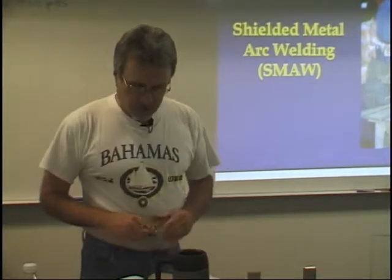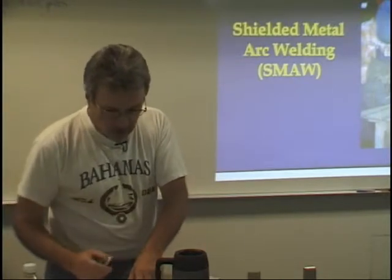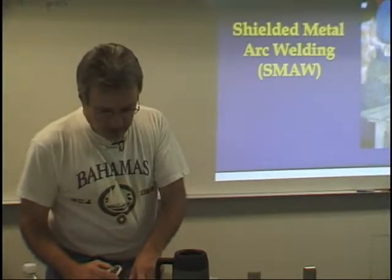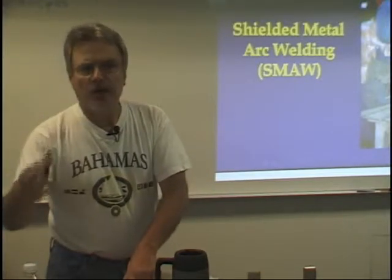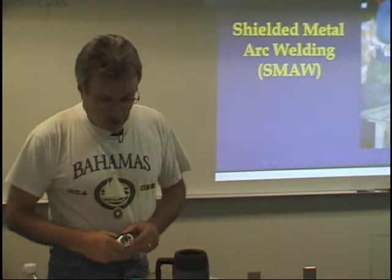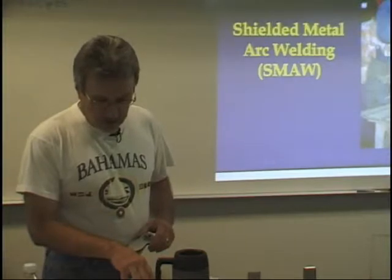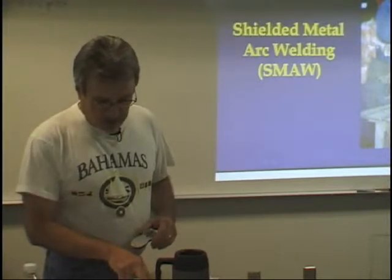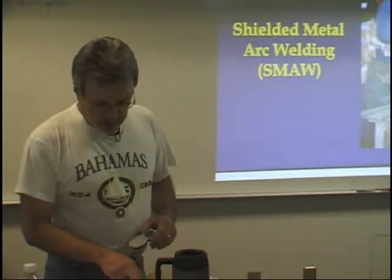Go over to where it says process capability. Shielded metal arc welding is one of the most widely used of the various electric arc welding processes. Rather than replacing shielded metal arc welding, the popularity of the other processes is causing the total amount of welding performed to increase. So SMAW hasn't decreased in popularity, it's just that some other processes have become more prevalent. According to a recent market study of equipment and process usage among the industrial market segments, SMAW represents 42% of the welding. GMAW and FCAW is 34, GTAW is 13, SAW is 9, and others 2% of the total welding.